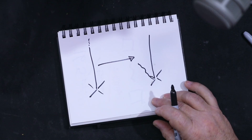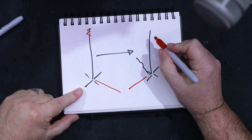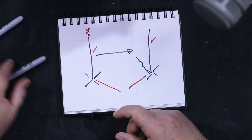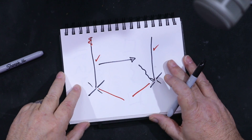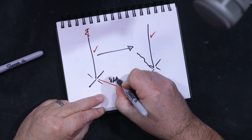A phased array is where you've got coax going effectively to both of these. These are both the same — not necessarily the same length, but the same on the meter. And ideally, the impedance is the same, not just the tune. So build them as identical as you can — same amount of radials, tune the impedance so they're as close as possible. Then, as we were talking about, Mr. Chrisman uses 71 and 84 degrees: 84 on each of the feed lines and 71 on the delay.